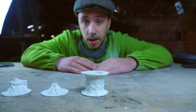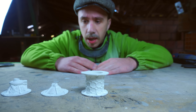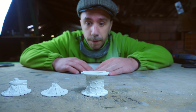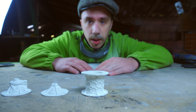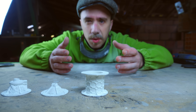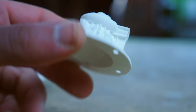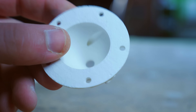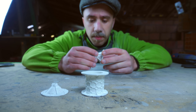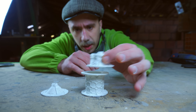As you can see the parts are not perfect, but they're pretty nice for a first try. I never tried to print the whole rocket before — I only tried the nozzle. Even though I used mostly 2mm thickness, there's not a lot of cracks or deformation. The exterior is a little bit rough because of the support material, but on the inside it's almost perfect and I think it should work. I just need to seal it with some cement or maybe some slip, and they fit quite nicely.